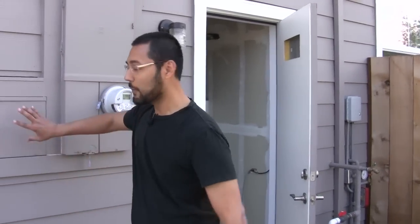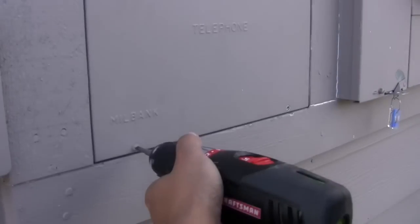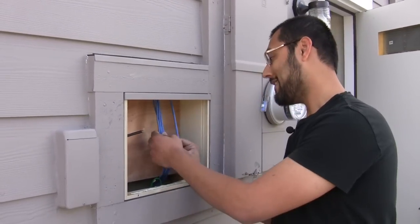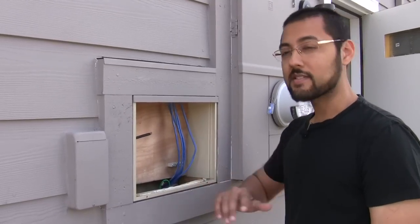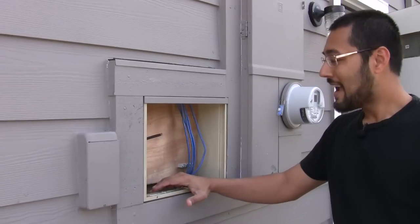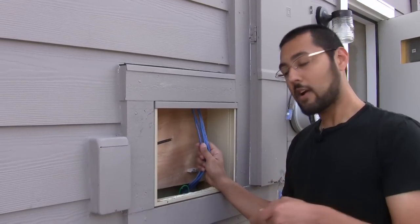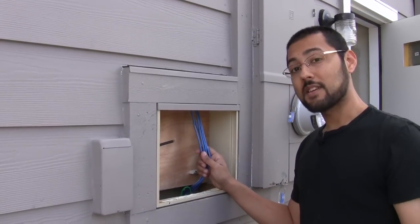To confirm that we actually had networking cable inside the house, we went into the telephone panel — I'm going to open this up and show you what we saw. There are five cables, and printed on them: Cat5e. Now Cat5e isn't certified to be as fast as Cat6 — Cat6 does Gigabit Ethernet speeds and Cat5e is not certified to do Gigabit Ethernet speeds, although it can reach that. We found Cat5e here and decided to go with it since this house is not that easy to patch with new cable.